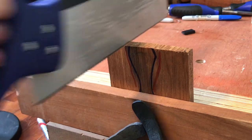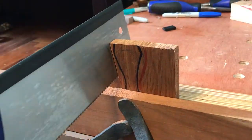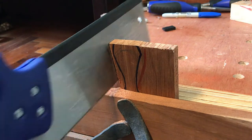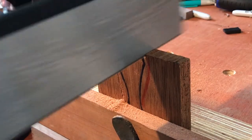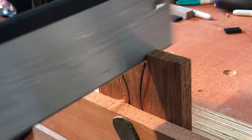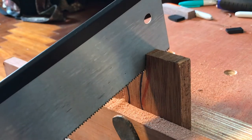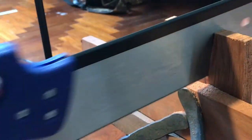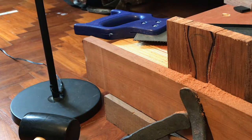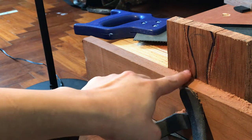Establish your line first. I was a little bit more adventurous on this side and I sawed a bit closer to the line because I left a huge margin on the other side. Now we're just going to sever it on these two sides — actually I might do a small V-cut over here because I was super generous with the line there.